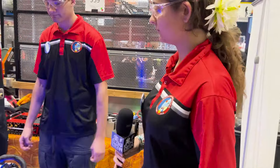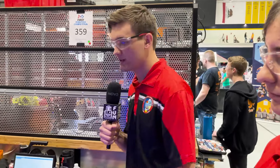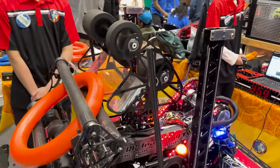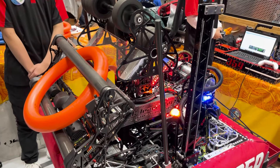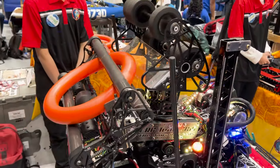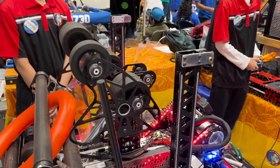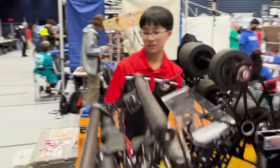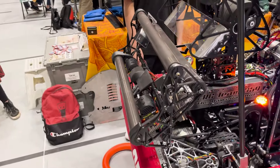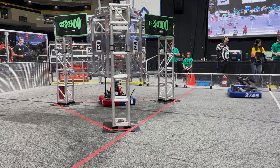Let's go through the set points the team uses in case all this vision stuff doesn't work out. If there's an issue on the field — like PhotonVision disconnecting or pose estimation going bad — we have set points that let us continue to be consistent. Each set point is tuned to a specific location on the field, so our driver knows where to go and just runs it to easily score. There's also a button for the amp that uses Motion Magic with only one button press to automatically move and score — that system has been really reliable at both of our events.